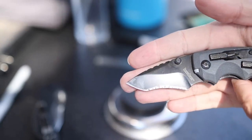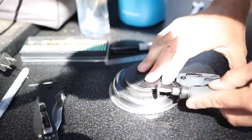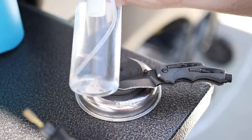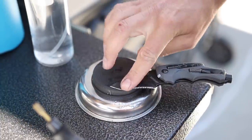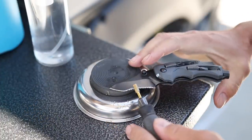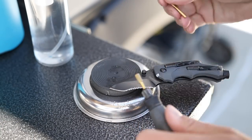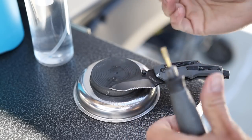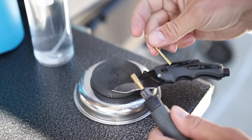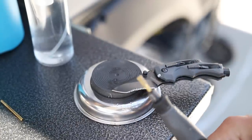I've got all my measurements marked. Now I'm going to go back and make small little divots with the cutting wheel. We're going to keep this on the low speed setting and keep spraying with cold water to preserve that blade temper. This is the tedious part because you can't do all your big scallops first and then go back for the smaller ones — because of how these bits walk in the groove to the right, you have to go each scallop in order: big, then two smalls, then big, then two smalls. So we'll keep having to switch out the bit, but you'll need to do that if you want good equal spacing.